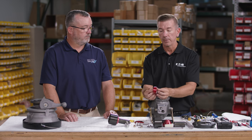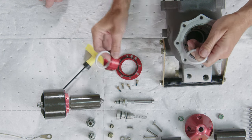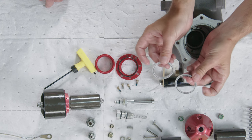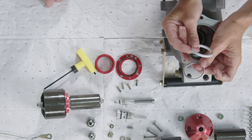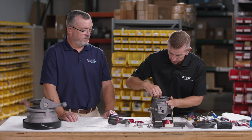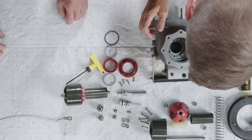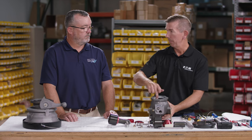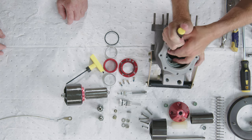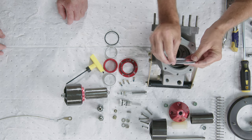In the seal retainer we have two Teflon seals — one on the upper and one on the lower. Each Teflon seal has a spring energizer inside that is not removable; when you get a new kit, the seals come with the spring already installed. The last items to remove from inside are another O-ring and the main piston Teflon seal, which also has a backup O-ring.